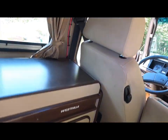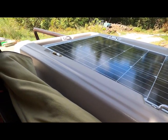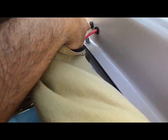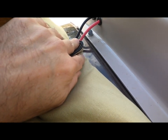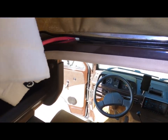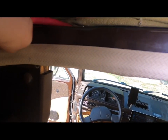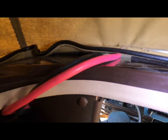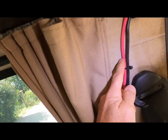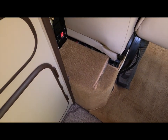Let me give you a quick look at the solar panel here. You can see I have a negative and a positive with some grommets here that are really, really watertight. I had to lift the rail a little bit — there's a tiny bit of space there, but I don't get any water intrusion. I put some foam in, but I'm going to have to put a little bit more in and extend it down a little further — I think the foam shifted. I drilled a little hole here, and the wires are tied off so they're coming down relatively neatly, dropping straight down to all the electronics below the seat.